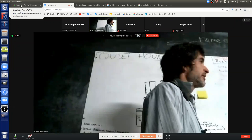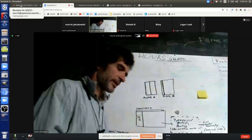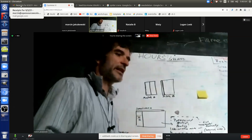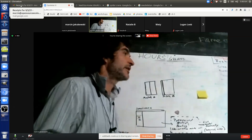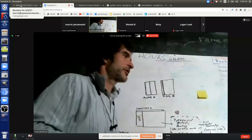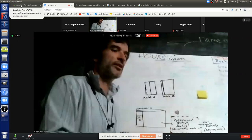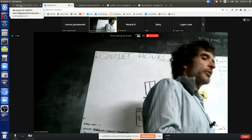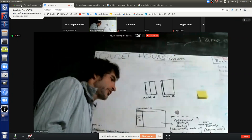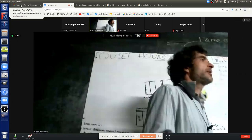Next step is the joists for the second floor. I want to ask this question because joists go up extremely fast. They need to be cut to size, which is 15 feet, 9 inches, because it's in between end joists, which are three inches total, 1.5 on each side. So you're doing a 16, you got 15, 9 there. Those all got to get cut. That could be a few people. We've got, I think, two or three sliding miter saws. Two at least, three maybe.